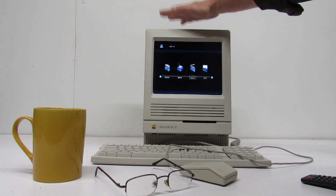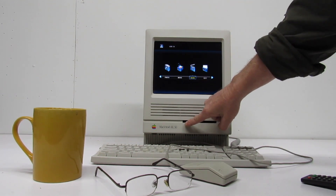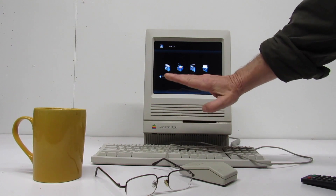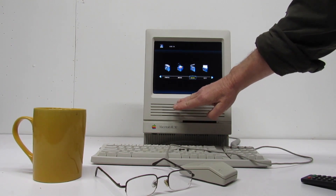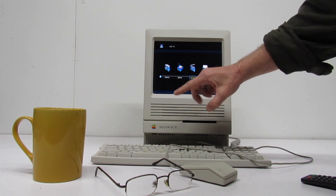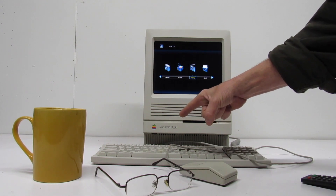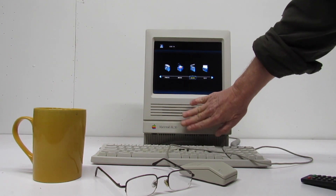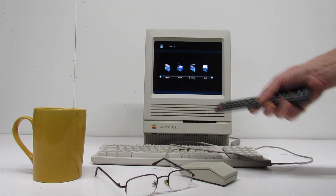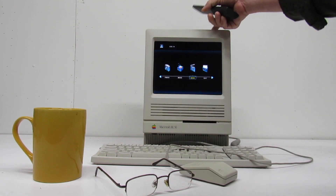Hello and thank you for stopping by and viewing my video. This is like the last video I did where I did the upgrade from the Macintosh SE30 to the Quadra 605, but in this build what I've done is I've integrated an iPad LCD and I have a Raspberry Pi installed, and I have a Quadra 605 LC475 — same board — also installed inside the case. Now we can use this as a media center through the USB 2.0 port that's on the rear.